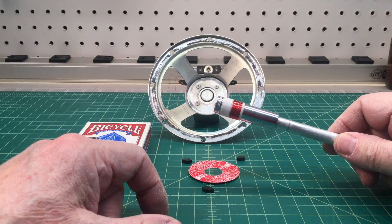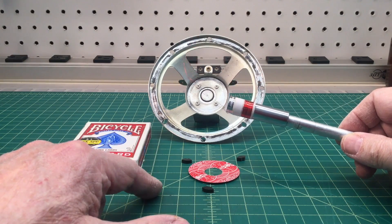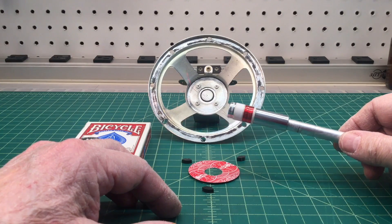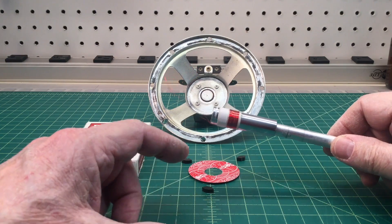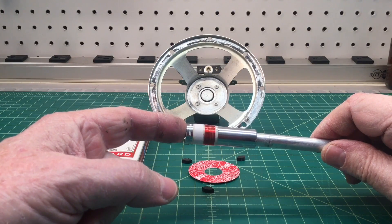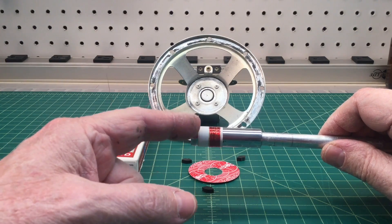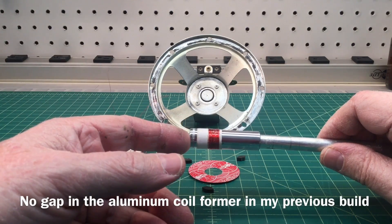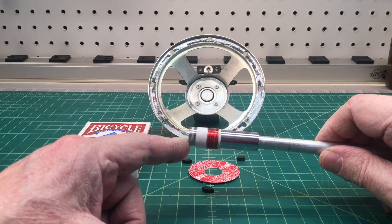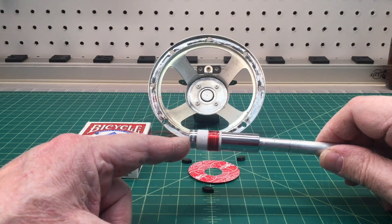It's a beautiful day, windows open in the shop. I'm challenging myself with a little 5-inch magnetic speaker that has no real value — you can pick these up for just a few dollars. I wanted to rebuild one to refine my knowledge and skills, particularly around the voice coil. The former is back to paper based on viewer feedback — I had used aluminum before, which can create a problem with the magnetic force between the center pole piece and the voice coil. This speaker is probably half a watt to one watt capable.